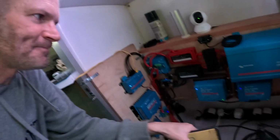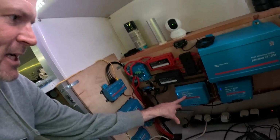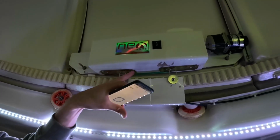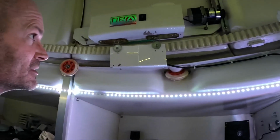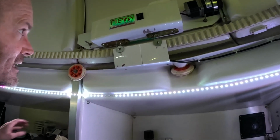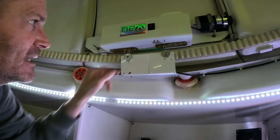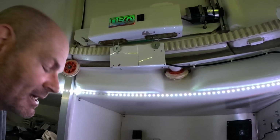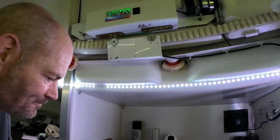Down at the bottom here, I've got the power cable in, so this is the battery charger now for the shutter. So it's all hooked up to the floating contacts, and I've also added in the extended plates, so it's a lot easier to find a charging position. And the important thing to note is that the width of these plates is narrower than the width of the contacts, so that it's not possible to short circuit the battery charger while it's charging the system.